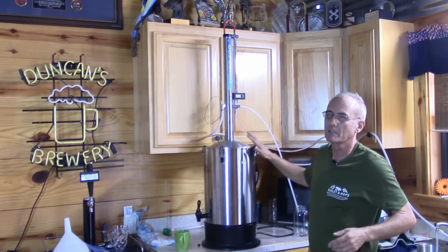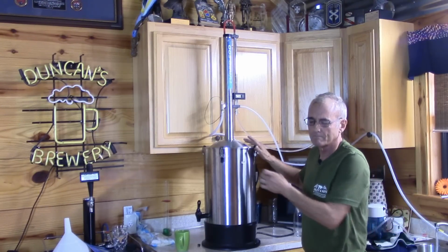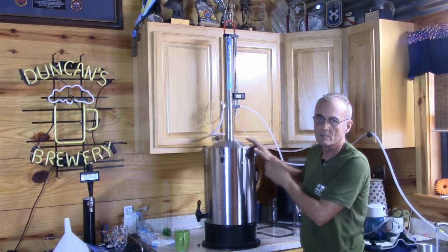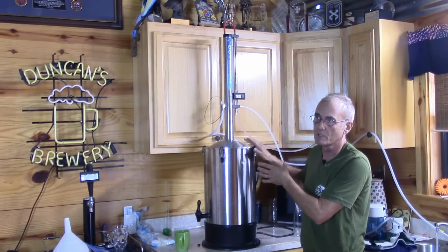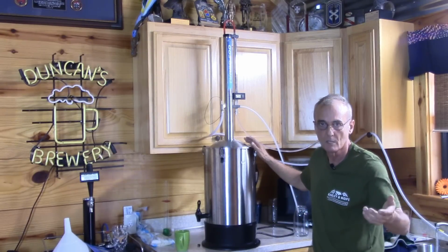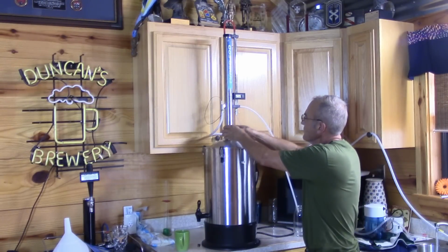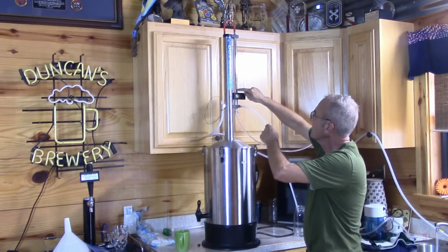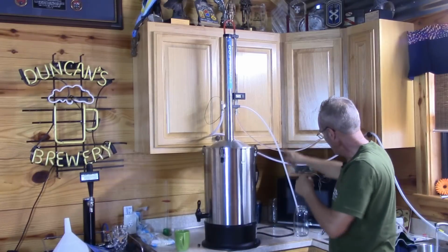And as a matter of fact, it's the thermal, oh my gosh, it's like a transistor. It's in the bottom. It's normally a closed switch, and it'll open when this reaches 125 degrees Celsius, which is over boiling. But that's about its limit. So the vapors travel up this column, and they go across into this cooling tube. So this is the column in the condenser, and then they come out here, and then they drop into the jar.